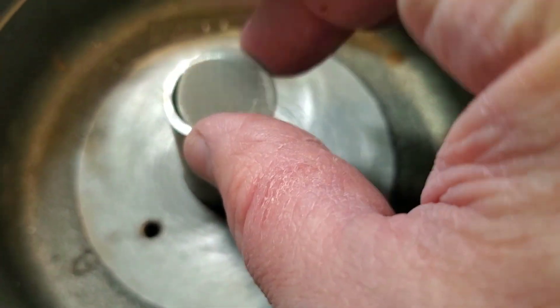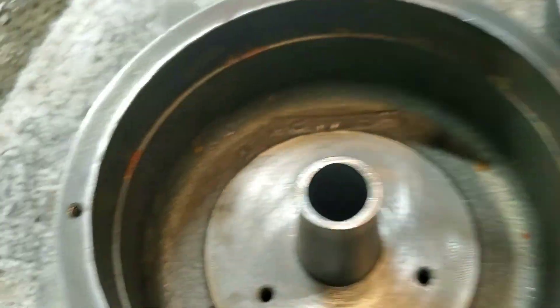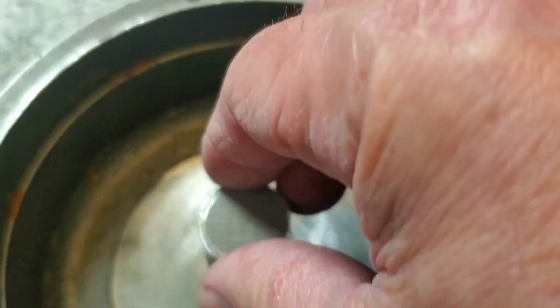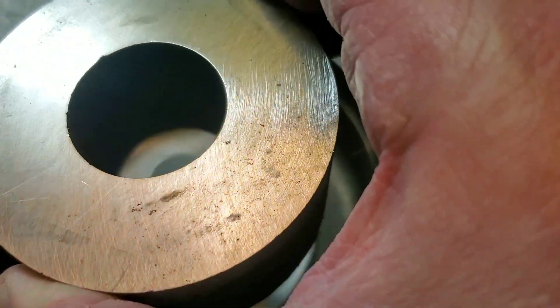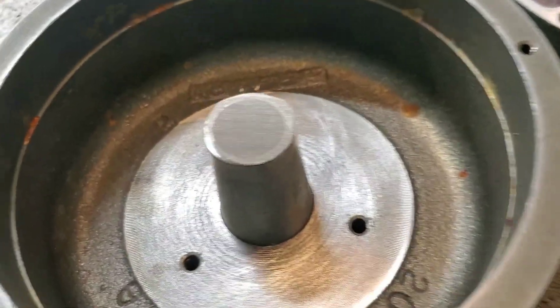There is a bug screen that goes on here. I punched new screens out — these were actually from JBL for the 2-inch driver, but I just punched them out of the bigger screen using a 7/8ths inch punch. That gets bonded on there, and then the phase plug fits on top of it, all nicely centered. The magnet slips over the throat and is pretty much held in place by it.